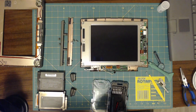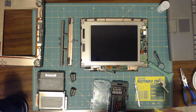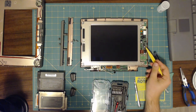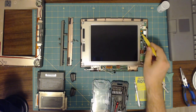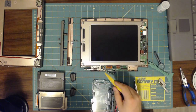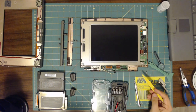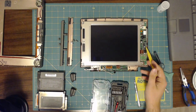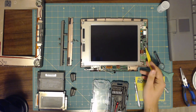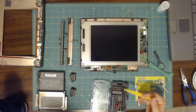So in looking at this, I don't see anything obviously wrong. Looking at each of the capacitors, there doesn't seem to be any obvious leakage there either, and the small ones similarly have no issue. If it is a capacitor issue, I figure, from what little I know, probably one of these electrolytics. There's four of them, I can order those, replace them no problem.